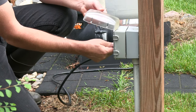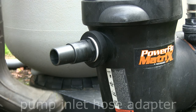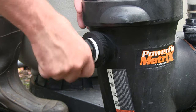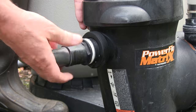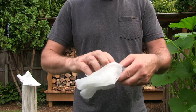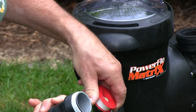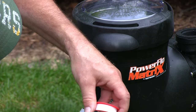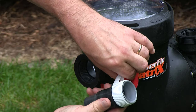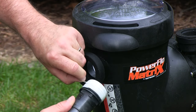You're going to want to make sure that you disconnect the power. We're just going to unplug ours, or you can just turn the breaker off at the panel. I'm just going to remove this fitting with a channel lock here, then peel the Teflon tape off these fittings and clean this off a little bit. That way when I thread it in, that's the proper direction for the tape.